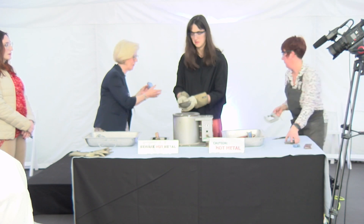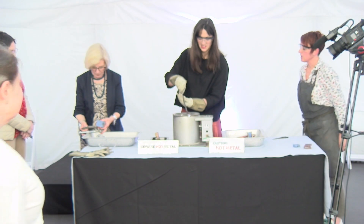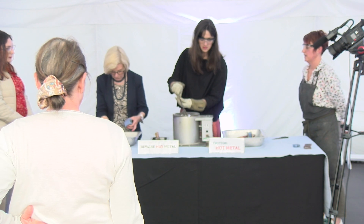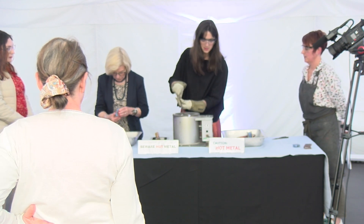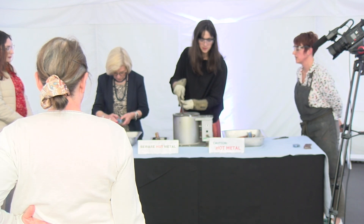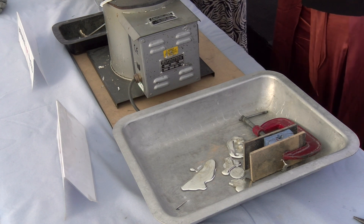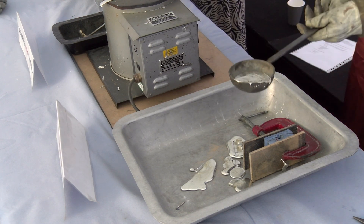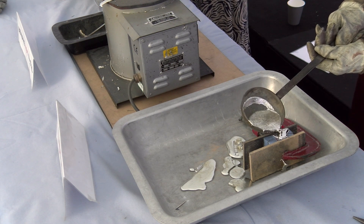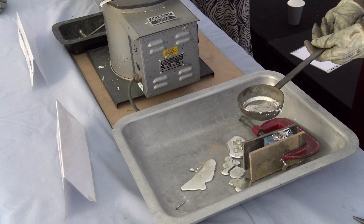Just check it's pouring off your ladle nice and cleanly. Half fill the ladle because any excess just goes down the side anyway. It's a bit slow so you need to be a bit quicker - keep pouring. That's it, that should be fine. If you have any questions while we're going through it, just ask.